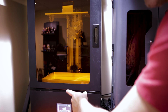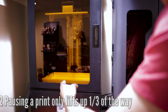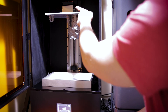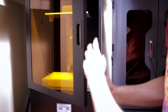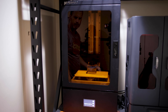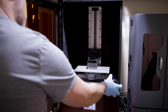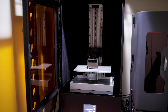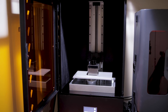The other thing they did is added an improved pause function. There was already a pause function, but what happened previously is when you paused, the build plate would raise all the way back up to the very top, and that's not exactly great. Now what happens is when you hit the pause button, it's only going to go three-fourths of the way up from where it's positioned currently. That's a really great improvement because you're not going to be sitting there for five minutes waiting for it to fully raise all the way to the top — even if it's two minutes, that's too long.